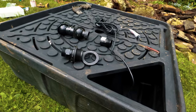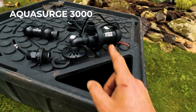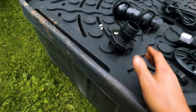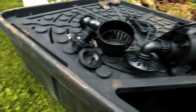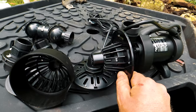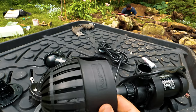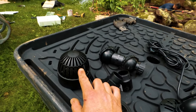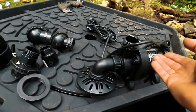I've got a series of different attachments and our AquaSurge pump — this is the AquaSurge 3000. We're going to be running inch-and-a-half pipe out of the back up to our spillway. This pump looks a little different out of the box: it has two separate screens — a pre-screen threaded onto the front and a larger screen over the top. These serve as pre-filters to prevent larger debris from getting sucked into the impeller, causing it to clog, lock up, and overheat.